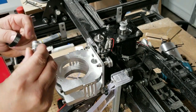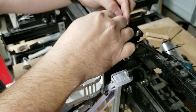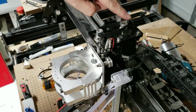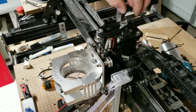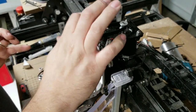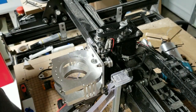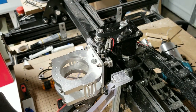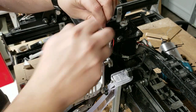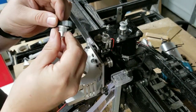Now you take your new pulley and your belt. Go ahead and line those up. First, slip it into the pulley on the back side. This is the newer 2017 Plus model where it's got the crimped pressed pulley on the stepper motor. If you have the older kit with the set screw pulley, you will order the kit with two pulleys and get the right size pulley to replace the original one. Fortunately, for the newer machines, this pulley does accommodate the 9mm belt — the older machines do not. This is the pulley that came off; it just does not fit with the 9mm belt.